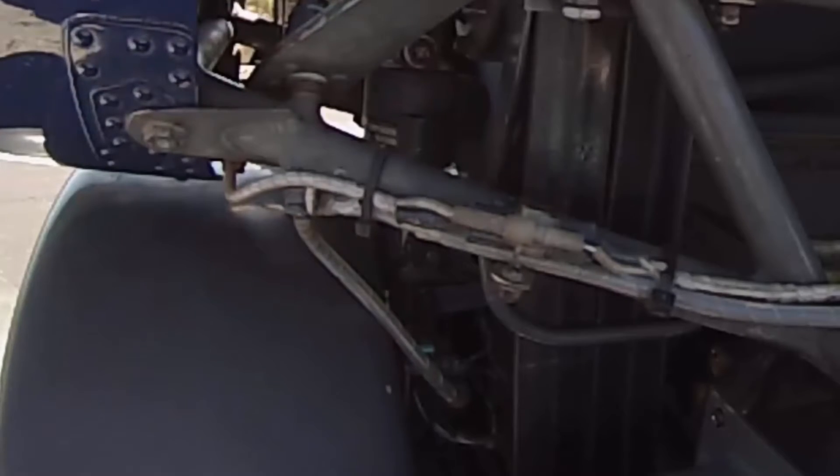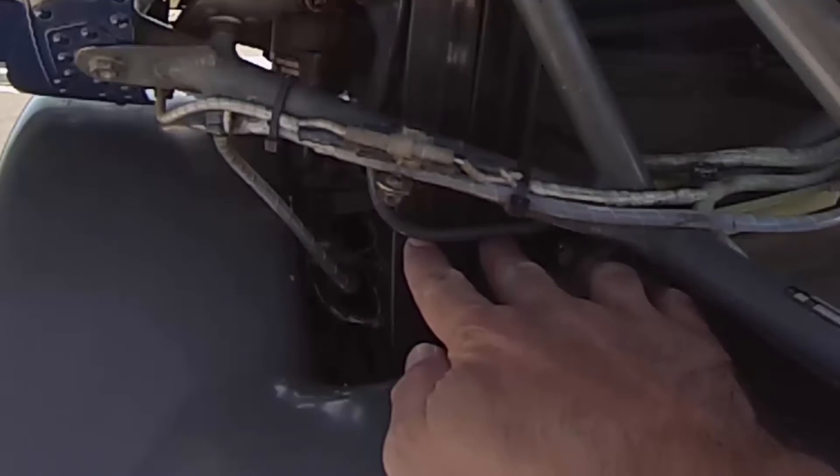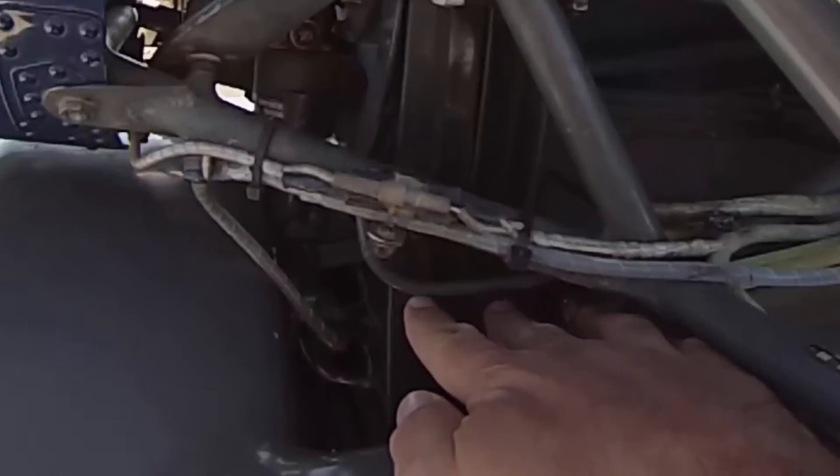It's also a good idea to check the tension of the belts. The easiest way to do that is to put one finger on each belt and just push it in to see how far it goes. This bar right here should come no further than the second knuckle on your fingers. If it does, the belts might need a little retention and possible replacement.